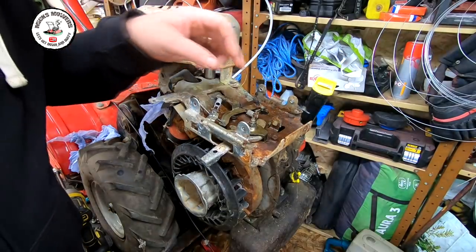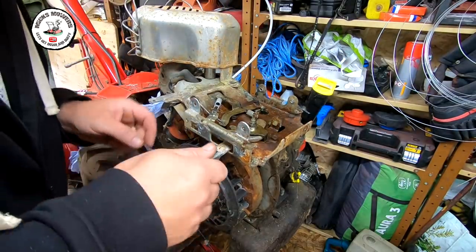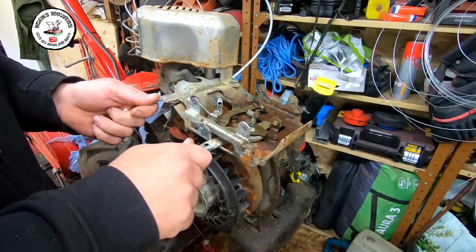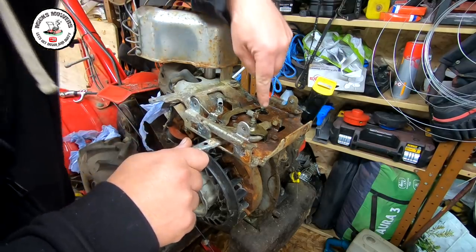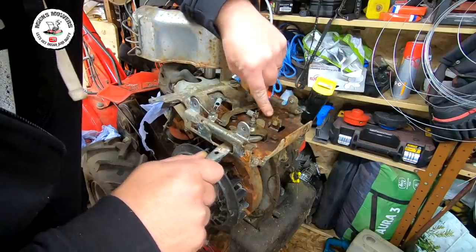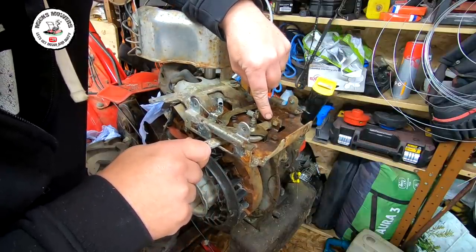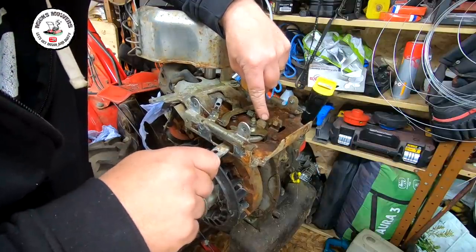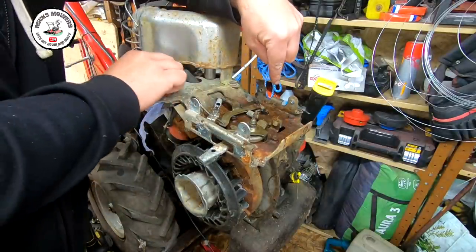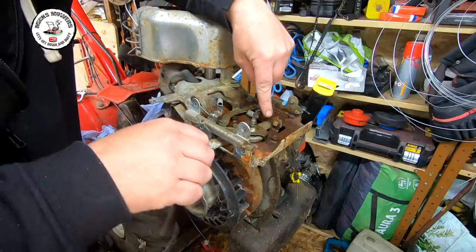A bit of a clean up now. The reason I wanted to clean it up is because this works very similar to a lawnmower. When you operate this throttle control, this is flat out, and then this will be stop. There is actually a kill switch here, which is exactly the same as it works on a lawnmower — just a little micro switch. When it bridges a gap, it cuts the machine out. That needs to work the same. And there's your governor arm just there, which is all nice and loose on the springs as it should be. So that's working fine.